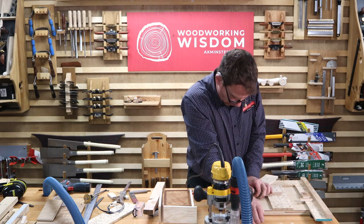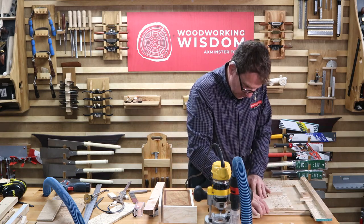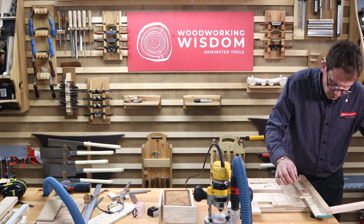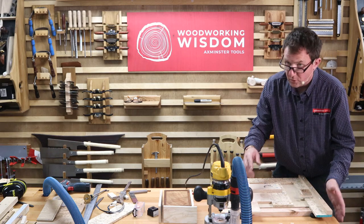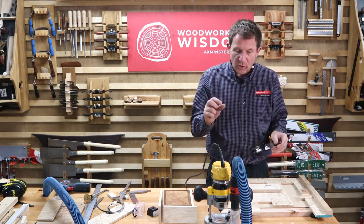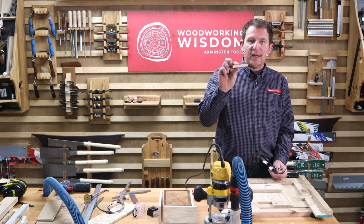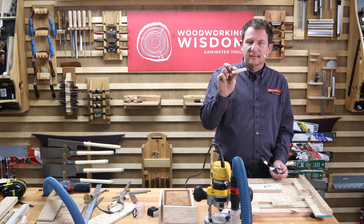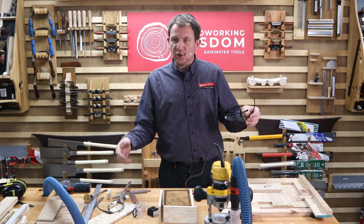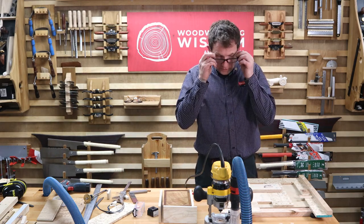And this is where your time goes, if you like. We're making things like the jigs and the setting up. Now, the aspect of making a jig, once you've made it, you could make one box. You could make 20, as long as we're not making 20, right? Your material is the same size. So same width, same thickness. So it's worth, if you're going to do a batch, maybe machine up a batch, get your wood in for doing the 20. You can machine them all in that same go.